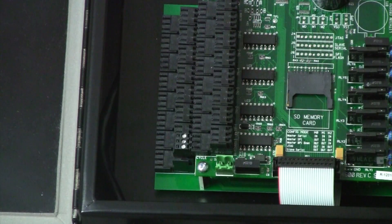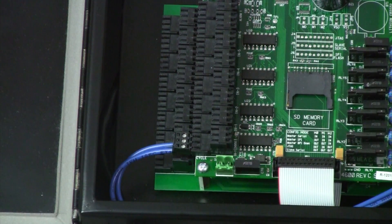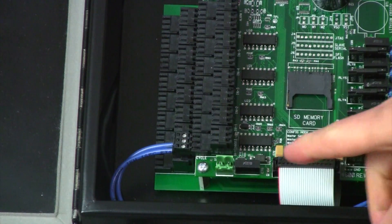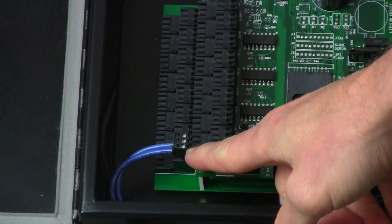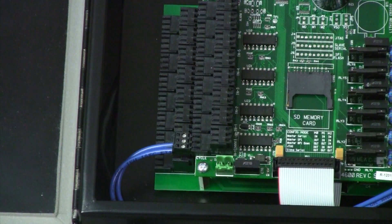If using the input monitoring feature on an SPR2000 system, you need to have a connection from the press so that the system knows if the press is running or not. This connection needs to be a dry contact switch closure and it plugs into the lower connector of the main circuit board, the bottom tier of the bottom connector.